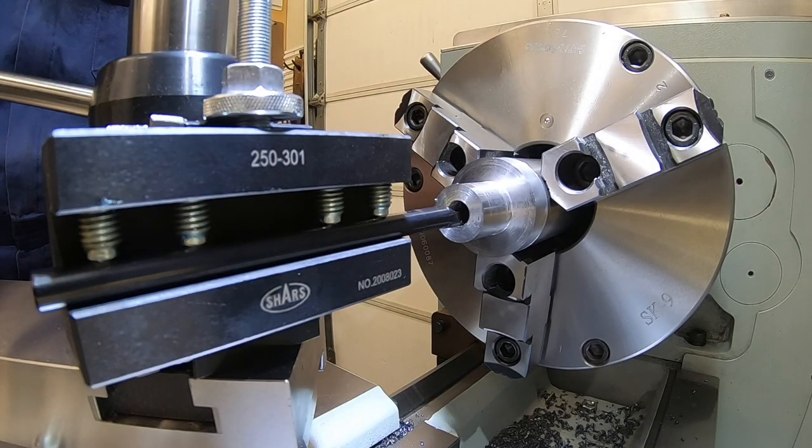All right, we got this little 3/8 boring bar on here. Let's see how this is gonna perform. We're gonna be feeding at 4 thou per revolution. Crank the speed up to 1800 RPM while we're on this little diameter inside. And just gonna take a little 10 thou cut, see how it does to start with. We'll get it out, we'll measure, see where we are.